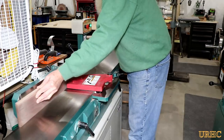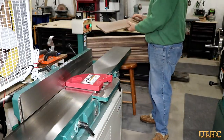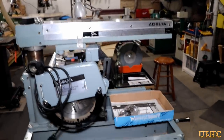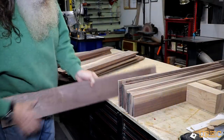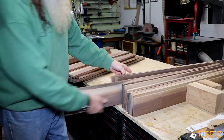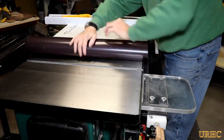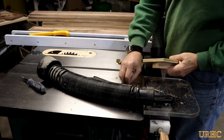As always, I'm going to get a good straight edge on one side to start, so I can rip it down to width. At the same time, I'm starting to clean out my shop — I had this radial arm saw I bought probably 20 years ago, used it for about a week, never really liked it, so that's going to be going on Craigslist to put the money towards a new router table. Once I got one edge straight, I stacked them up to pick a couple different random widths to rip them down to, took measurements, and decided what I was going with. I started ripping — with this thin stock the saw kicks out a lot of sawdust.